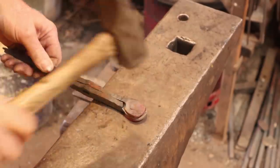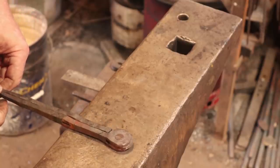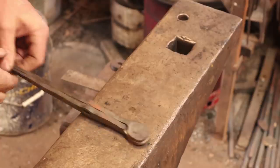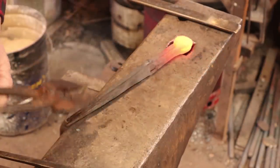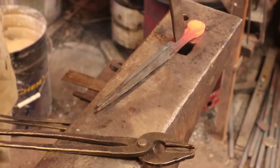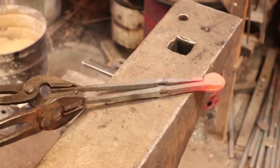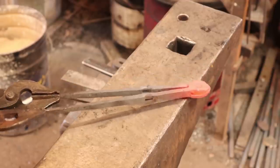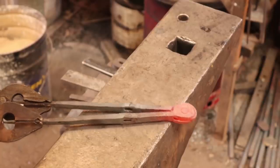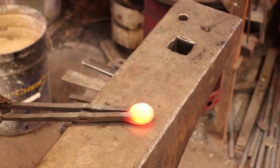Now these are definitely going to be too tight to do anything with, so we're going to heat them up just like you would a pair of tongs and work them back and forth to get that freed up. Then it will be back to the vise and the files and the grinder to clean up that head and clean up the legs. Once we've done that, then we'll worry about the wing. To be able to grab both legs, I need to get the thing to start opening up a little bit. I'm just going to put a chisel in here and try not to deform anything — that opens it up enough that I can grab these with two different pairs of tongs and start working them back and forth. Be real careful not to bend it right through here, so you might use just the torch right up in here and not heat this at all, which is what I'm going to go do. Hopefully that will allow us to get that to open.